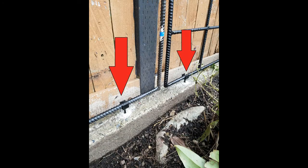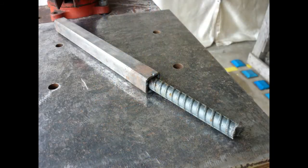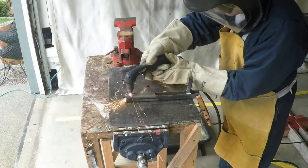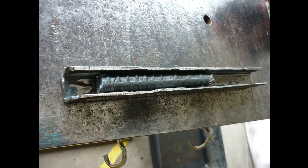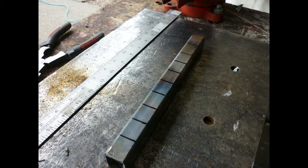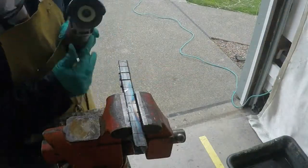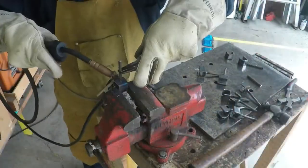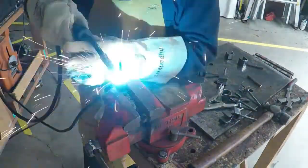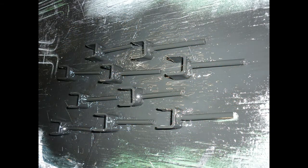Here's how we're going to fix this. We build support brackets that will hold all of the sway, and the brackets will be mounted in concrete. I found a piece of square tubing that would fit 5/8 rebar. I used my plasma cutter to cut one side of the tube out. This created a U-shape that would readily accept 5/8 rebar. Make marks every inch and cut the metal down into one-inch pieces. This cutoff wheel produces a much finer cut than my plasma cutter. Cut some 1/4 inch round stock, 4 to 6 inches long, and weld them onto your U-shaped brackets. You're now done building your supports, but make sure you cover them with a good layer of paint. Uncovered steel and the great outdoors aren't a good mix.